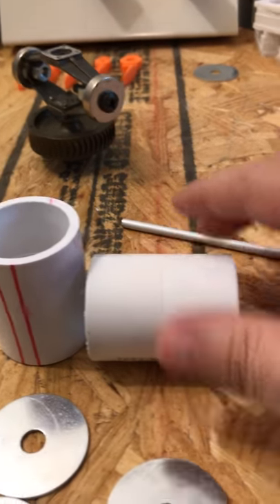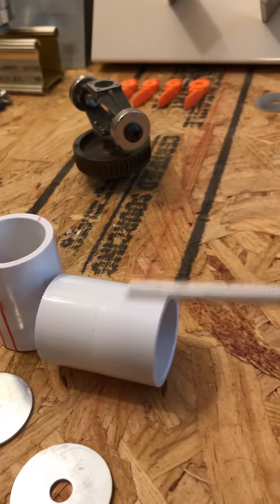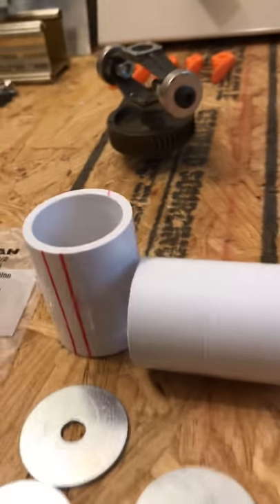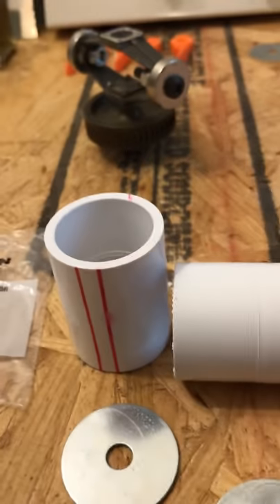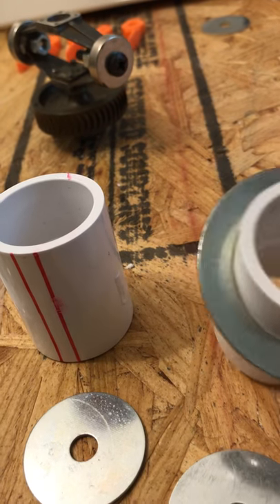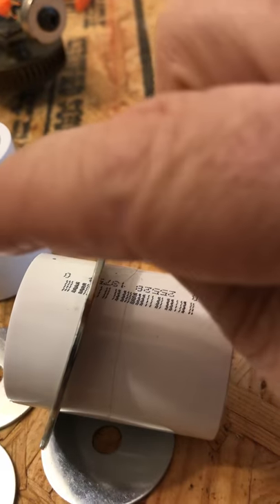To do this, we're going to wrap magnet wire around and around — back and forth, back and forth — and that becomes coil number one. So the wire does not run off the edges on either side, we're going to use these rings — I can give you part numbers for those. This ring goes around the cylinder and will be hot glued in place so it stays. This cylinder here is two inches long, and the magnet going inside is only one inch in length, so I'm going to put one ring one inch apart and leave a half inch on each side open and free.